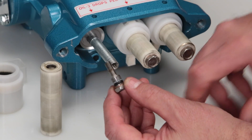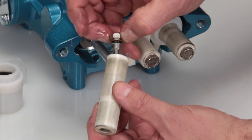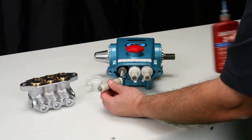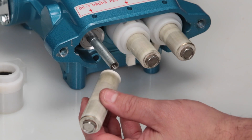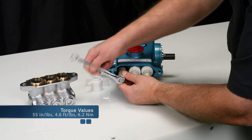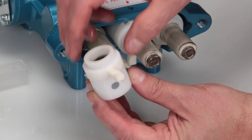Add a lubricant before reinstalling. The plunger retainer can only be installed on one side of the plunger and should fit tight into the end of the plunger. Install the retainer into the plunger and press into place. Before installing the plunger assembly, apply thread sealant on the end of the plunger rod. Install the plunger assembly and tighten using a 10mm wrench. Torque to specification. Next, install the plunger retainer with the hole and long tail of the wick facing down.